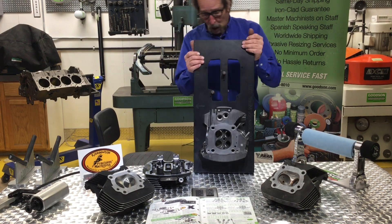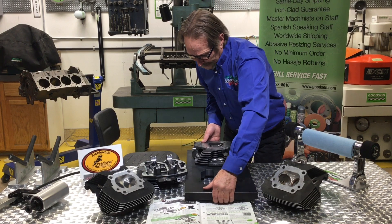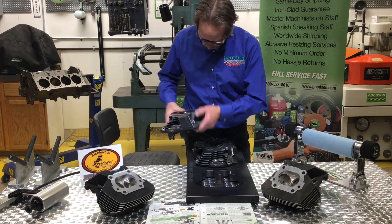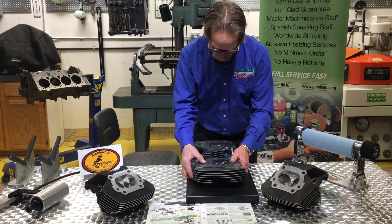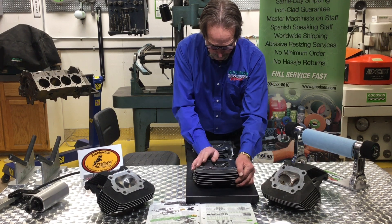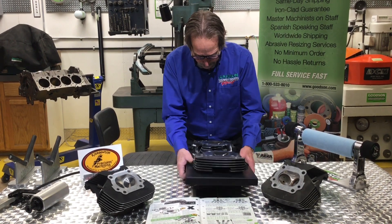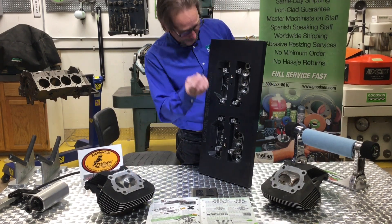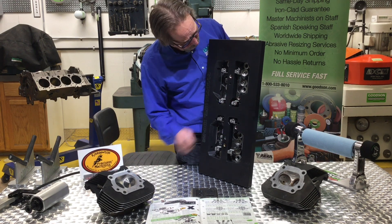It mounts quite easily on those dowels. I'm going to see if I can show you that easy mounting system without turning this video on and off. So again, line up our dowels — everything goes through here like that, and it is quite the honeymoon fit all the way around. On the back side is where we start inserting our socket head cap screws. It'll come with these socket head cap screws — there are five of them, and there are five places for them to go.